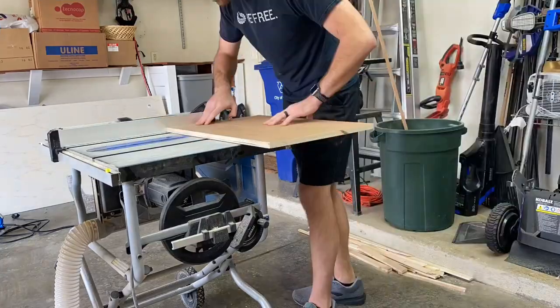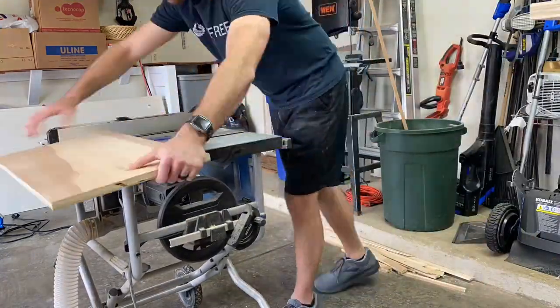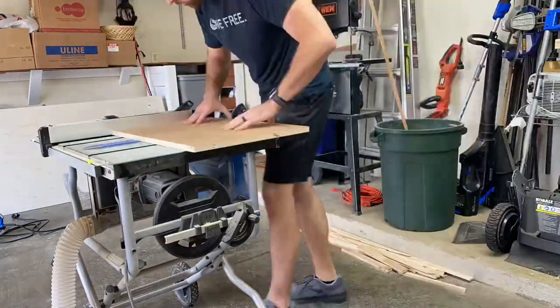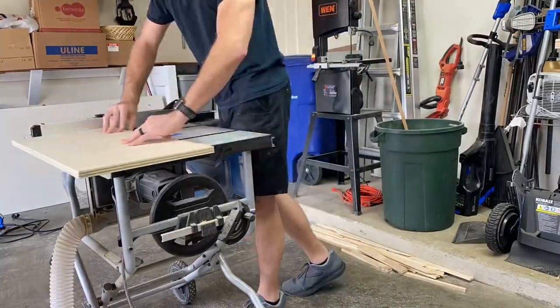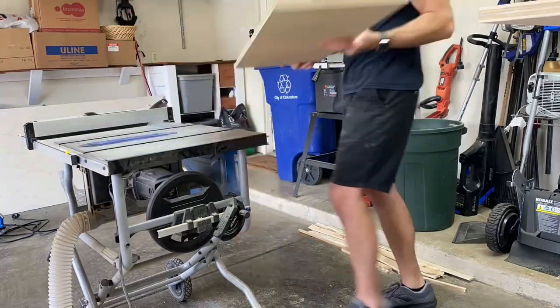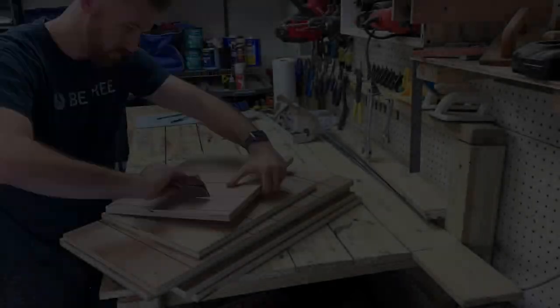After I broke down the three-quarter inch plywood, the first step was to cut it to size and then add the fake shiplap look. I accomplished that by using the table saw — you can see I have a sheet, I believe this is one of the barn doors, and I'm just making cuts. These are about a quarter of an inch deep into the three-quarter inch plywood, spaced out about five and a half or six inches apart to get that panel look I was going for.